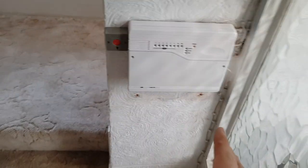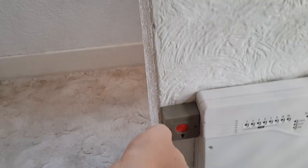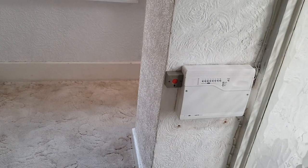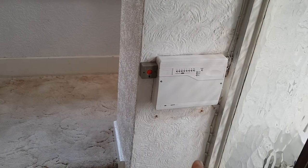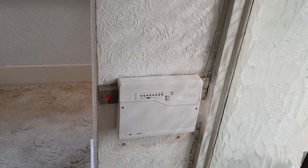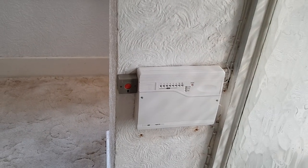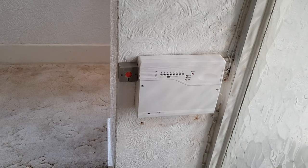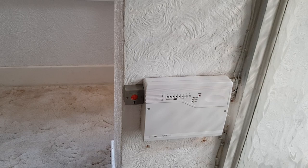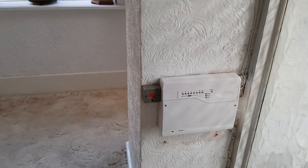Apart from the panel, there hasn't really been any changes to the system. Oh yeah, I added that panic button in. There was never a panic button on the system before. I'm trying to think what changes have been. Just the panel, obviously, and I swapped it for this a few years back. And the bell box was a CQR Type C vented polycarbonate, and I put a Ventcroft in just to bring it a bit up to date. And, you know, looking back, I probably should have just left the CQR in. There was nothing wrong with it, and it even had a little comfort LED that used to flash.